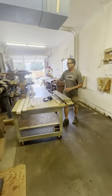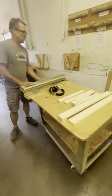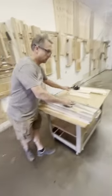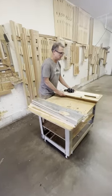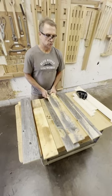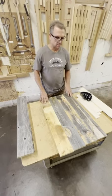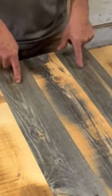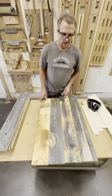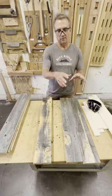The side frame is flap sanded and beveled. Now we're going to move on to the panels. As I mentioned earlier, I want to determine what's gray and what's going to get stained. I have four boards per panel, and laying them out I can see the cut man has got two that are completely gray, so those I'm just going to flap sand with 150 grit.